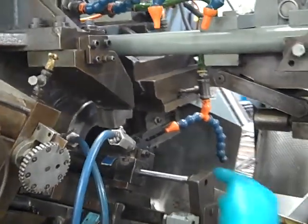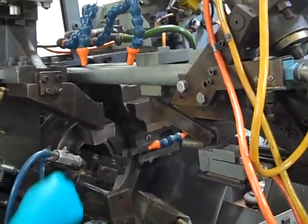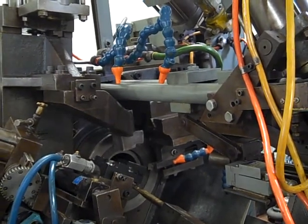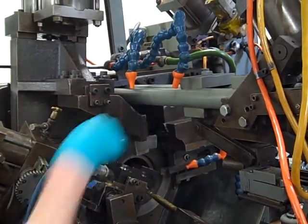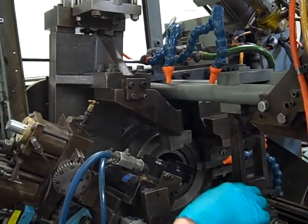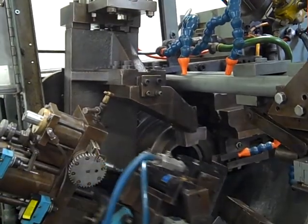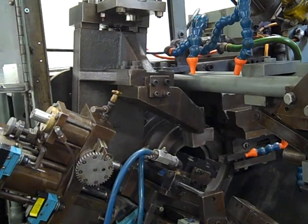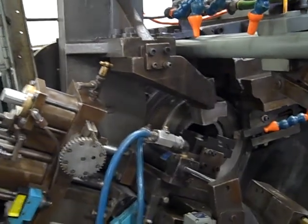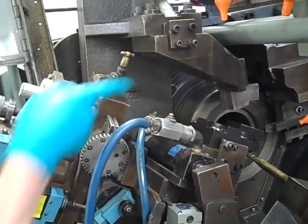If you work around the back here, you can kind of get all these tools at once. You see the back cutoff slide. The parts catcher will come in — listen, it just goes back. The parts catcher comes in and waits for the cutoff slide. The cutoff slide is still coming in. If you hold it real close, you might be able to see it. Stock stop comes down. Now we feed out — simulate a bar feed. Top slide comes in. Chamfer, recess, cut off. Zoom right in there, you'll be able to see it. This is feeding in right now. Recess. And it's still cutting off.